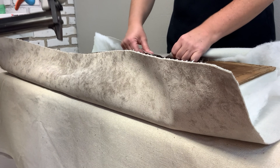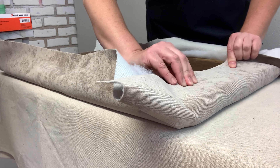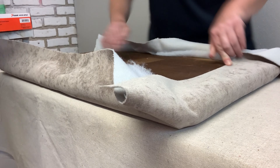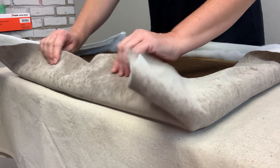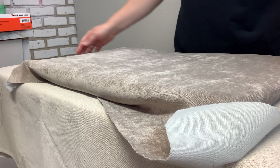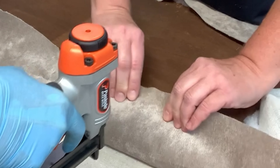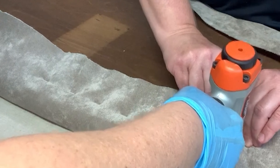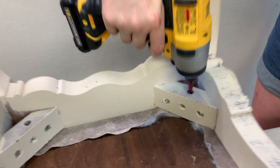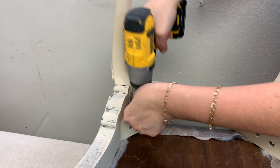I have a full tutorial on how to reupholster a seat, which I'll add in the description and cards above. A quick tip when reupholstering: make sure you pull it taut from each side. Put one staple on one side, then working the opposite, pull taut and add another staple, then go to the opposite end, pull taut, add the staple, and do the same with the other side. Then, and only then, flip it over, make sure it all looks good, flip it back and start adding all the staples around the sides. Once all the fabric was stapled on, we cut the excess fabric off, and the seat was reattached with the original long screws from the underside of the bench.